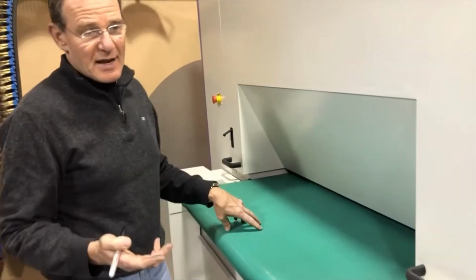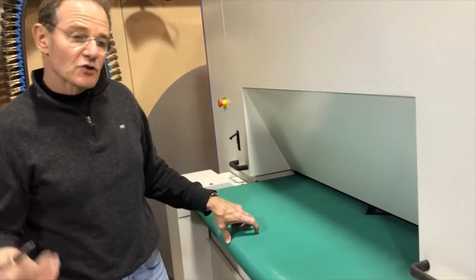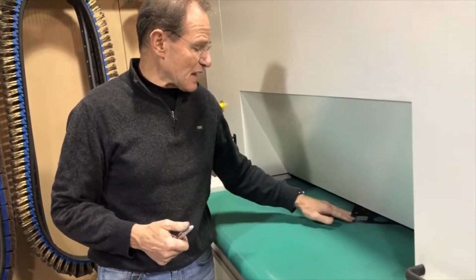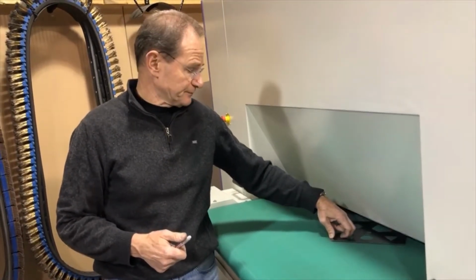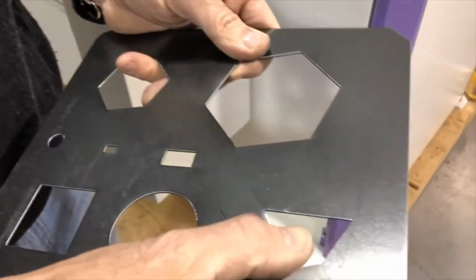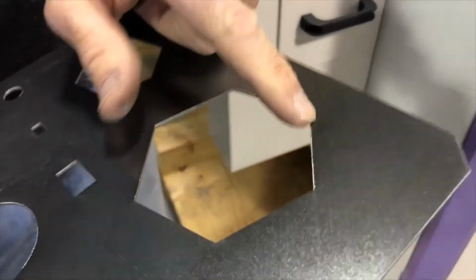If you can cut it clean, you get a good edge rounding result, so that the parts are painted around 2 to 3 feet per minute. And you get something that is a safe edge somewhere around 3 to 5 feet per minute. So again, we have very nice and good edges all the way around, but here where we have the dross, we just get rounded dross but not no dross. We have a little bit also on here.